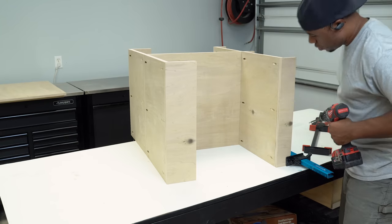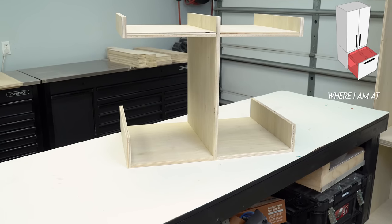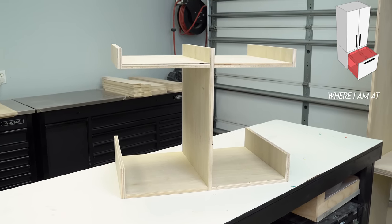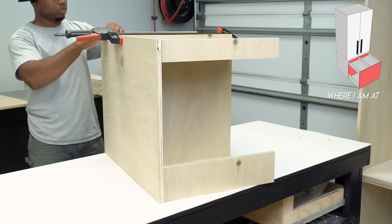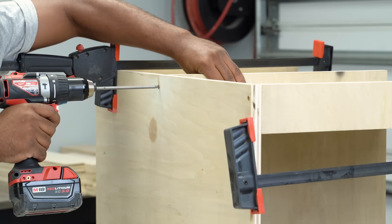This is the intersection of the massive bottom drawer. At the top, you have 2 compartments for low profile tools, and in the lower section, you have a bigger storage area where you can place tools at the bottom and enough space at the top to hang drills and other power tools. And at this point, I just need to add plywood to the front and back to close this up. The front and back will not be visible, so I can drive screws right through them.